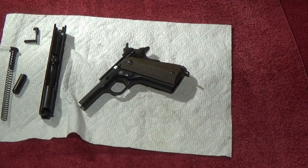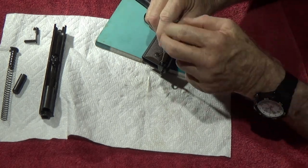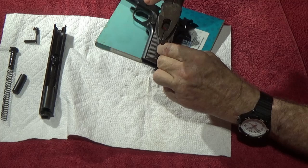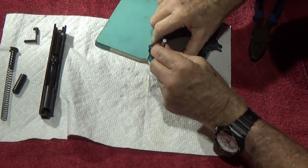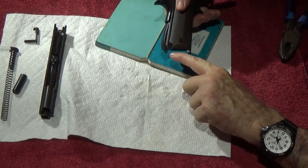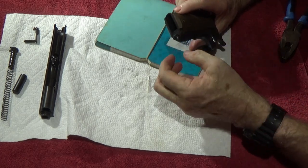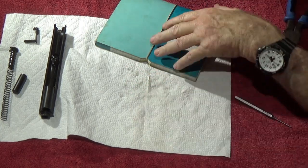Last step: go ahead and drive that last pin in. Get the notebook out so I don't poke a hole in the table. Take my punch on the hollow side of the pin and use my fancy hammer — go real soft on the last couple of taps. Give it one more little tap and it went all the way down. When it's perfect, it'll be sticking out on this side just a little skosh and flush on the other side. The pointed piece on the main spring saddles up in that machined valley in the pin and locks it in place. John Moses Browning thought of that — he's a genius.